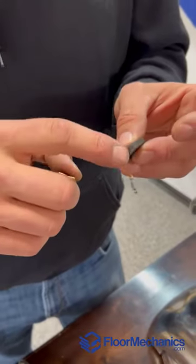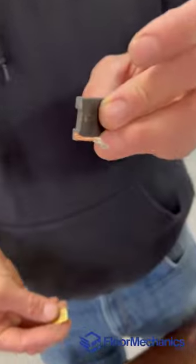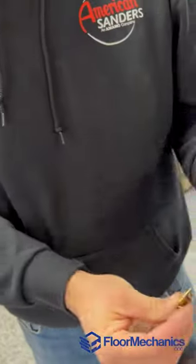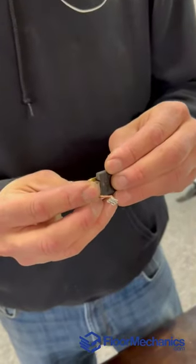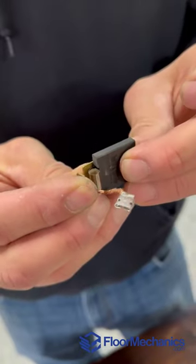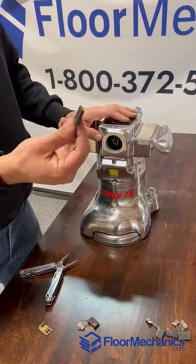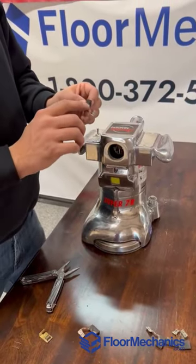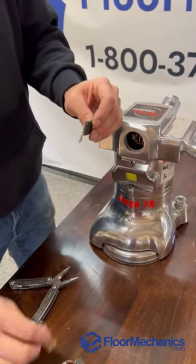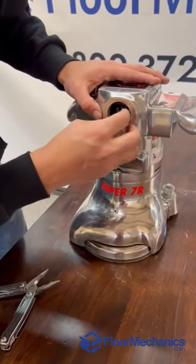When you're putting them back in, it's really easy. There's a little slot there, and then the clip — that being inside there is what holds it in place. As this is wearing, this will keep that end up against your commutator. Putting it back in is very simple — you just want to make sure that it is facing the side with the clip.